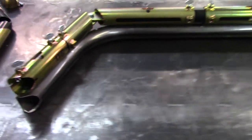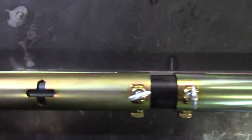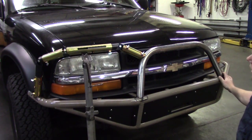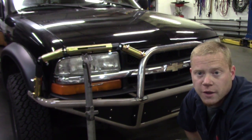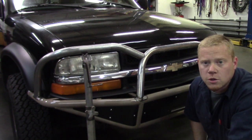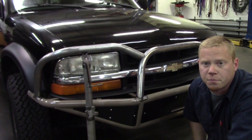Here we have the final tube with the jig sitting on top. You can see how everything lines up to each other all in the same plane. The one difference is that the final tube obviously has a bend which has a radius, which is a little different than the jig—that's about the only real difference. Copes are all lined up and everything. Now that I've got this tube all done and tacked in place, I can set up the tube jig for the next tube. Stay tuned for the next video where I set up the tube jig and copy it like that. Check out our website at 911motorsports.net, subscribe to our YouTube channel, and follow us on social media platforms.